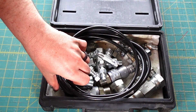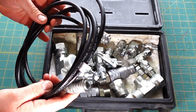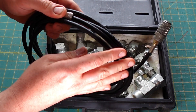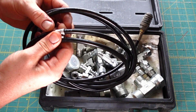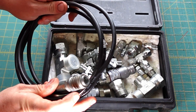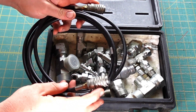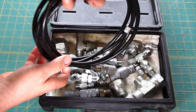The first thing is this hose, and this hose has a CAT part number on it — it's 177-7860. I think that's just for the hose; it doesn't include the couplers. But it's an eighth-inch hose that's rated at 6,000 psi.